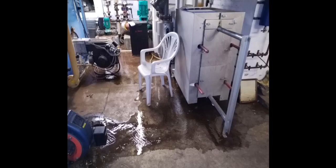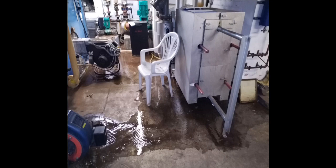This site had a leak from a plate-to-plate heat exchanger - you may have seen me at this site in previous videos. Guess what happened? Leaked again. There are three forced draft burners here. For some reason the system lost pressure - I heard there was a leaking radiator upstairs that some of the other guys had to deal with. Nonetheless, this system lost pressure; pressurization dropped below the minimum of one bar, the boilers shut down, temperatures dropped, and then the plate-to-plate began to leak.